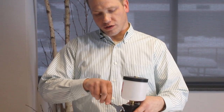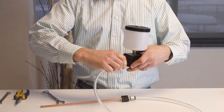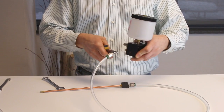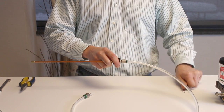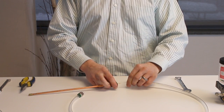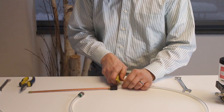Finally, we're going to talk about how to retrofit your system from the old capillary splicer to the redesigned capillary splicer. We'll start by removing the push-in fitting from the pump block and pulling that back to expose the capillary. Using needle nose pliers, pull the capillary from the barbed fitting on the pump. Next, we'll remove the push-in fitting from the nozzle coupler block, pull that back to expose the capillary, and cut the capillary from the old capillary splicer.